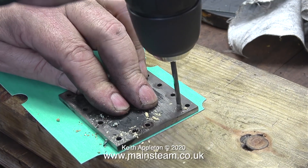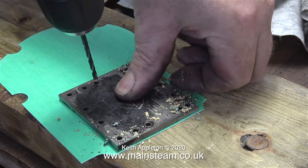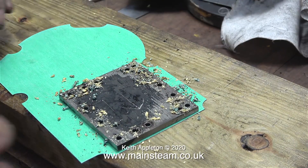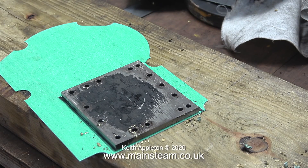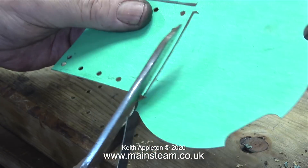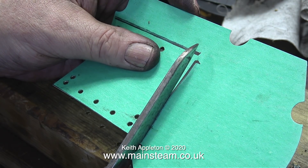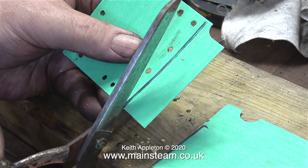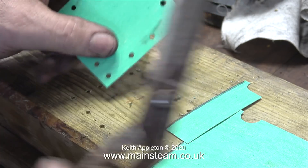Returning now to the bench to finish the steam chest cover job. On the bench I put a large piece of wood; I'm firmly holding the steam chest cover onto a piece of gasket material and drilling through it with a small drill. Then all I have to do is draw a felt-tip pen line around the steam chest cover and cut it out with a pair of scissors. A quick tip: if you're doing a job like this, cut on the outside of the line — it really doesn't matter. If the gasket ends up sticking out a bit from the joint, it's very easy to remove it using a Stanley knife. Any other type of craft knife or scalpel will also do the job.